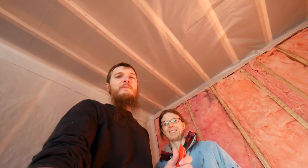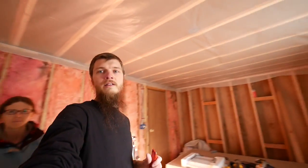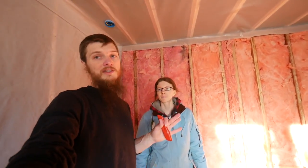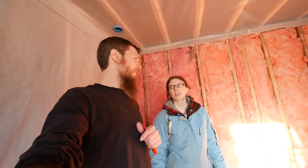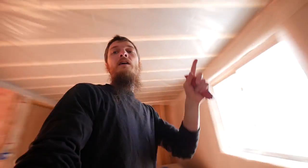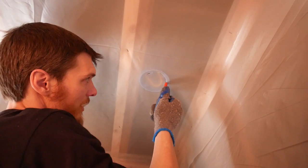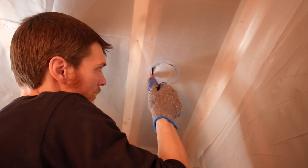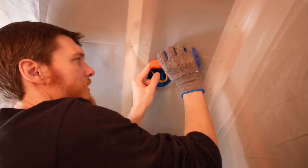We got it up and it doesn't look too bad — a few wrinkles in it but nothing that's going to stop the drywall. The room is coming together now. If you're just joining us, you might be wondering why we're putting plastic up with no insulation in the attic — we're going to be blowing in cellulose insulation later after the drywall is up. Right now I'm cutting holes for the light fixtures. I'm leaving about a quarter inch so I have a little room to stretch the plastic around it and keep a pretty good air seal.